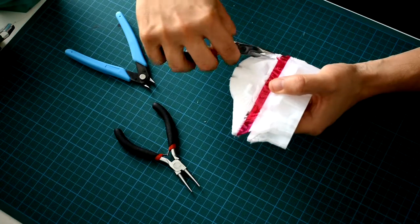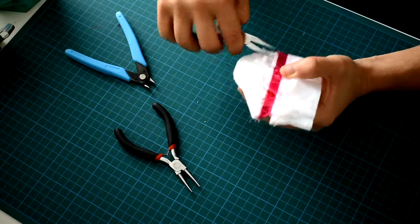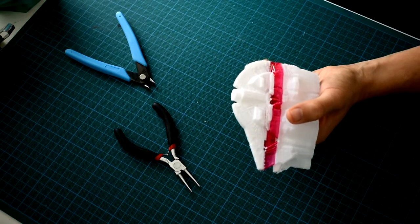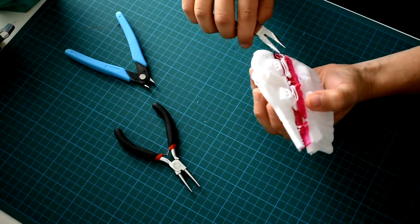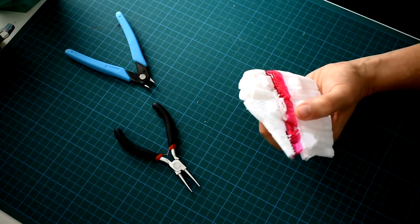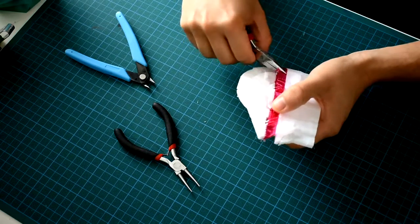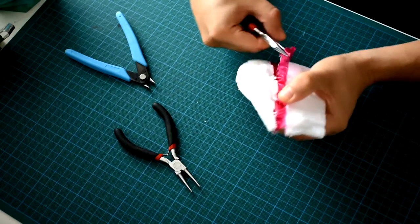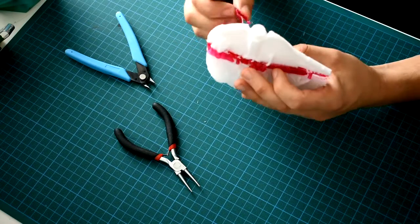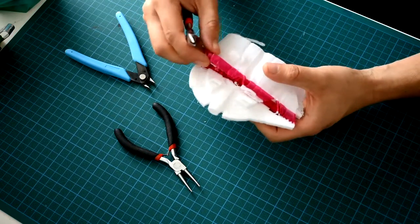Keep the work surface nice and clean. We can clean up any smaller spots later on, but the initial goal will be just to rip these things off. You can actually see where the filament changes that it's breaking off a little bit easier than on any other lines. That's probably just because of the different material — it's from a different manufacturer, so you kind of notice the adhesion is slightly different. But added to that, the adhesion will be a little bit different because it cooled down a bit between the layers.